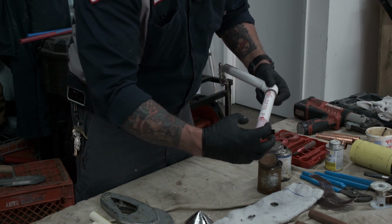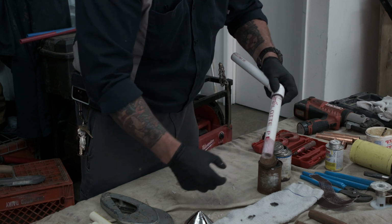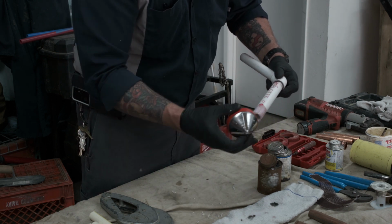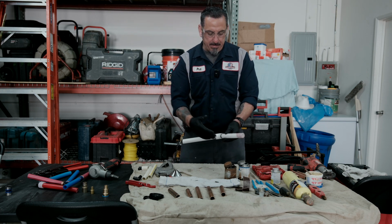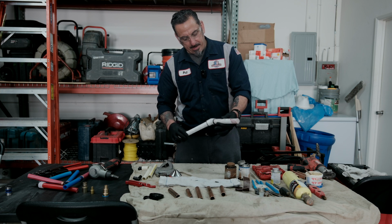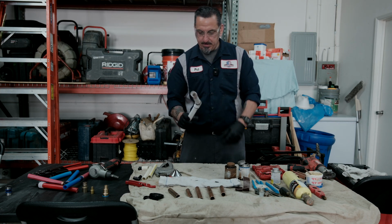It also softens up the pipe, so if you don't ream inner and outer and you push a cup, you could peel part of this. So this is why I think it's a really good idea to ream inner and outer before you start applying your application. So that is PVC Schedule 40. Same application would go for Schedule 80. Very common pipe used out here. Charlotte makes a really good PVC pipe. That's the PVC application.